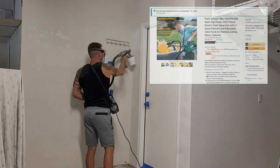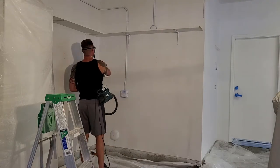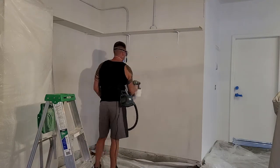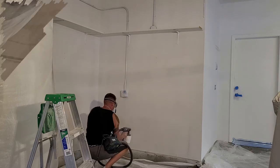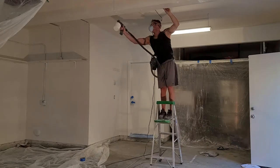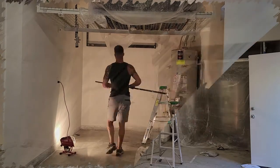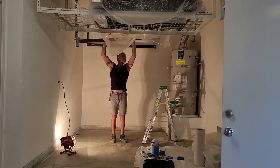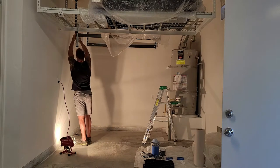In the past I have painted large areas using a paint roller, but I always found it to be slow and messy. I decided to try a paint sprayer, which I purchased off Amazon for $60. I use a paint sprayer with a separated turbine to lower the weight on the nozzle attachment, which I found to be easier to use. The paint sprayer worked great, taking me approximately 5 minutes to paint an entire wall. Every wall required 3 coats of paint, and I used a total of 3 gallons of paint costing $45 to complete the garage.